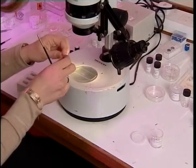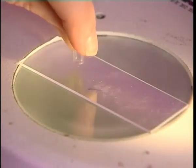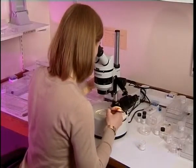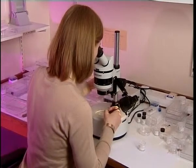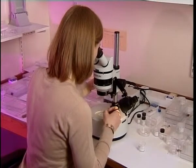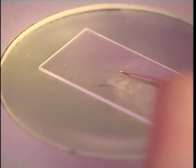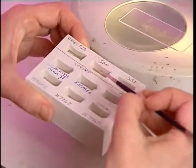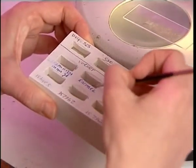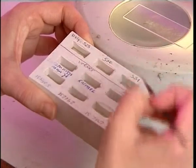I'm going to put this sample onto a microscope slide and look at it under this low-powered microscope to decide how I'm going to mount it and which orientation I'm going to use. And then place it into a mould to mount it in polyester resin.